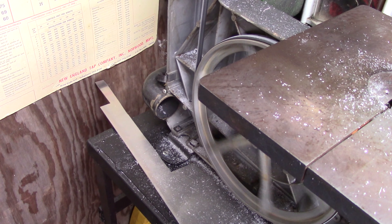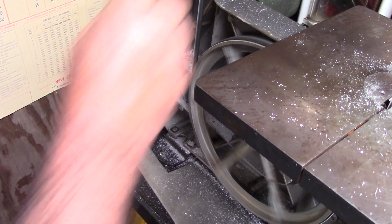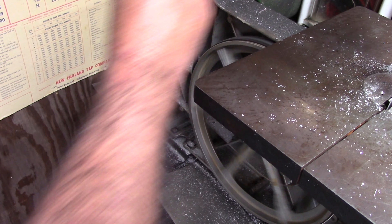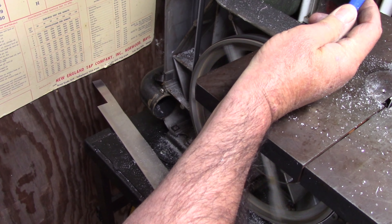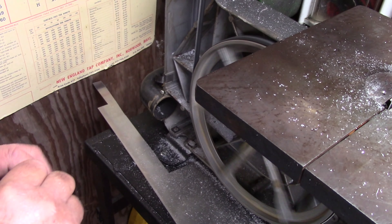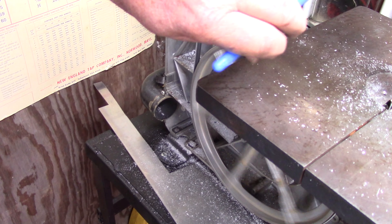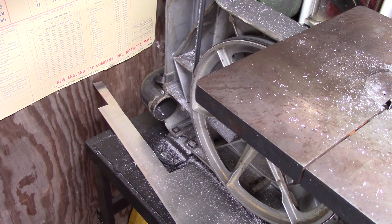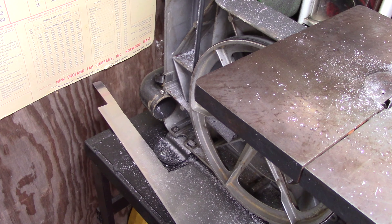So I just wanted to put that into slop so you guys could see — yes, we have things that go wrong sometimes. One thing about the way this saw is made is the tires get a lot of metal on them. So what I've found to do, especially if I do a lot of cutting, is periodically I'll just take a brush with the guard off, open it up like that, and just brush it out to get the little rubber chips off my tires and get a little more tire life that way.